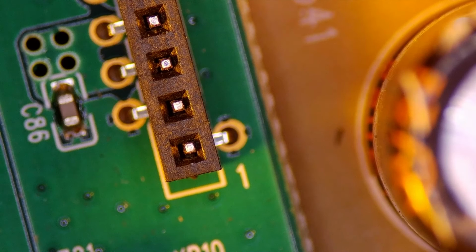I got 26 volts. I'm going to see, maybe I can get this in here somewhere. Maybe I'll put it here, switch this over here, and we'll get an overview. Just like this. Yeah, that should work. Okay, so I'm going to put one pin here on the ground, and we're going to check. So we have 26 volts, as we should. Another 26 volts. Next three pins are ground. So 26, 26. That's a ground. That is also ground. Ground. That is 26 volts. 26 volts. 26 volts. And then ground.